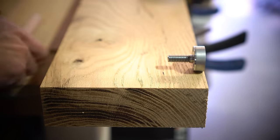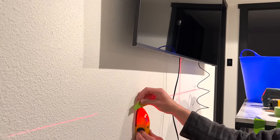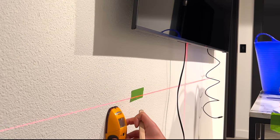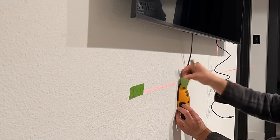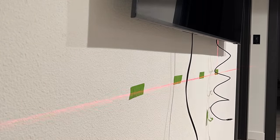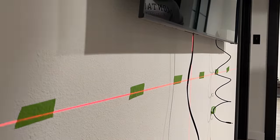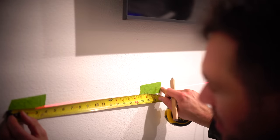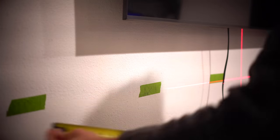In order to accommodate this feature we first need to figure out where our stud placements are located. I'm placing this shelf right below our TV and luckily the TV itself is centered right in the dead center of our stud placements. If it wasn't, our screw placement might not be aligned properly, which is a big factor when we want to make sure that each one of these screws is centered appropriately and eye-appealing. There are actually six studs I could be hitting on this one shelf, but I decided to only hit four, two on each side, so I take a measurement to guarantee I know where dead center of those stud placements are and then transfer those to our shelf.